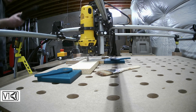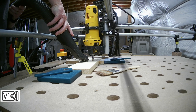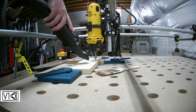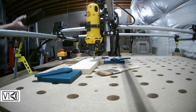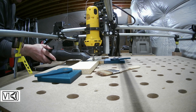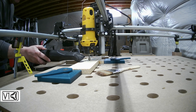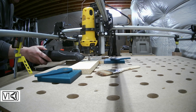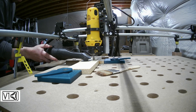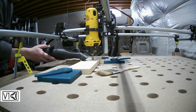You can probably tell this is quite an aggressive cut — we're at six millimeters deep and we're just going straight in, no finishing cut, just doing it quickly. Remember, when you do these inlays the only part that's really important is the angle of the sides. The bottom and top don't matter — they're not actually going to touch anything. There's going to be clearance between the bottom and top of the female part, and ideally the top of the male part doesn't touch the bottom of the female part or it's going to create more of a gap between our edges.